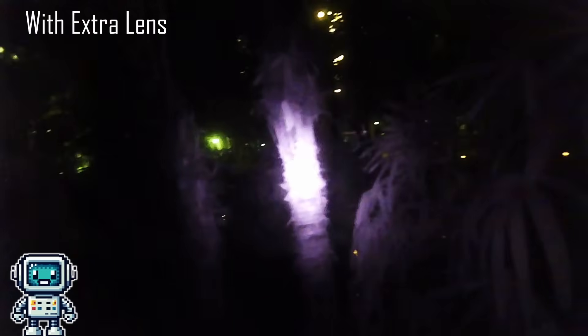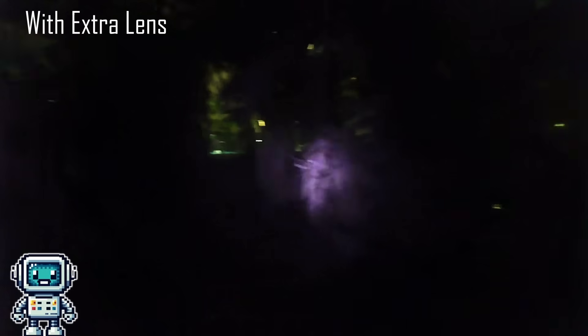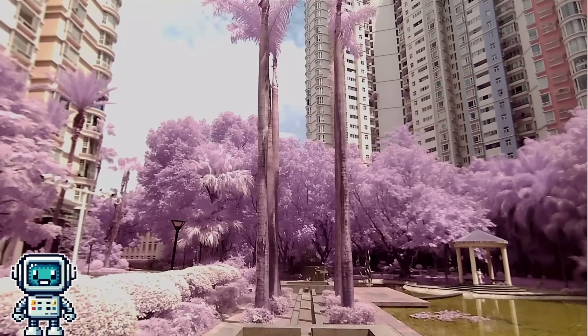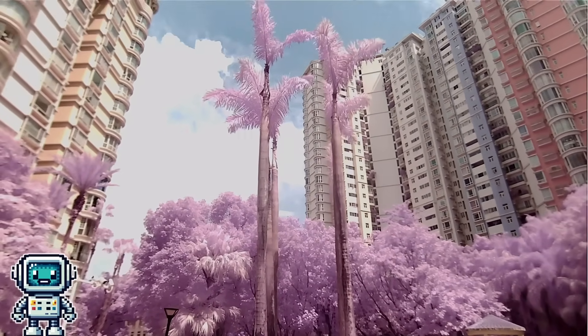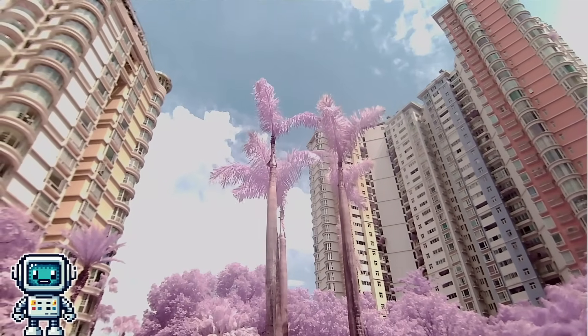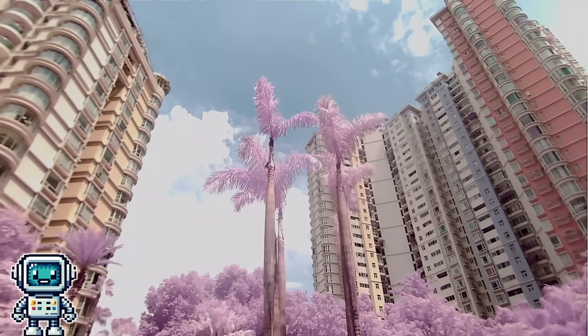When outside, this limitation becomes quite obvious. The power that can be taken from the USB when configured as an OTG interface is limited to about 500mA, which doesn't buy us a lot of final optical output power. In daytime, viewing the visible and infrared bands together gives some stunning visual effects. It seems that plants are incredibly reflective in the near infrared band.